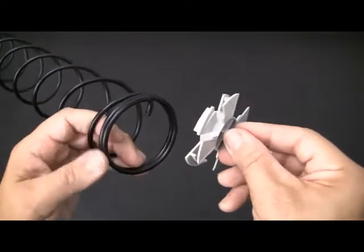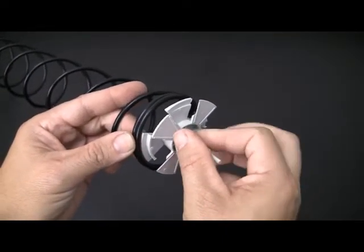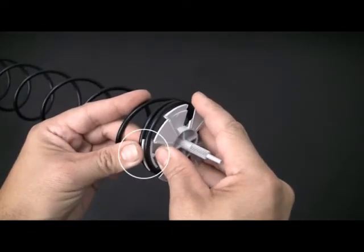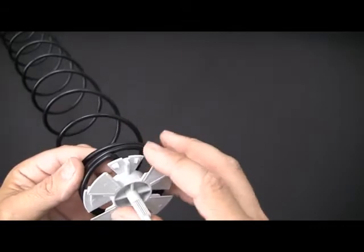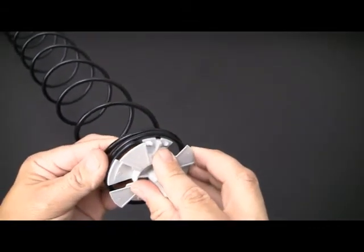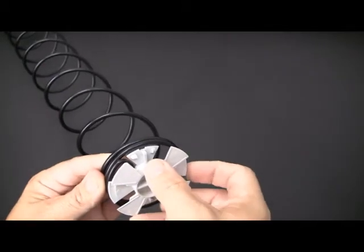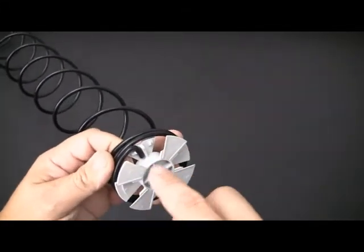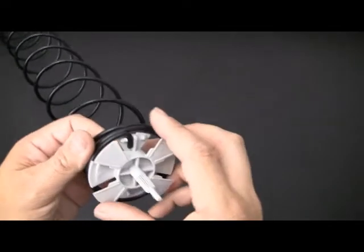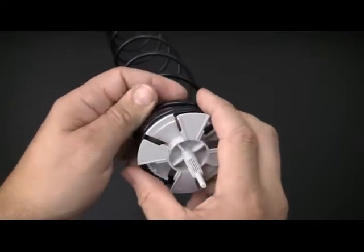Begin by sliding the bottom of the coupler in between the last two turns on the coil opposite the tail of the coil. Then snap the opposite end of the coupler into the end of the coil with the tail to the left side of the tab and ear. Finish by pressing in slightly on the coupler and rotating it counterclockwise until the hanging tail of the coil snaps over the left ear. You've now successfully installed the coupler.